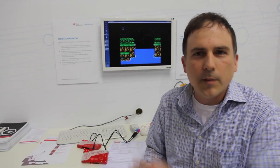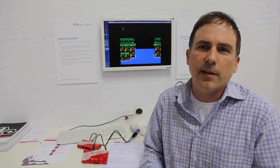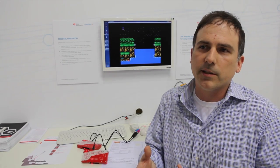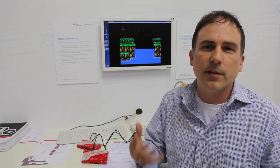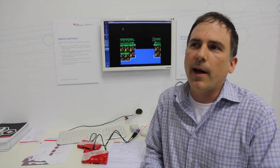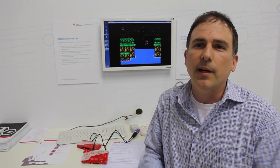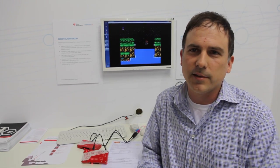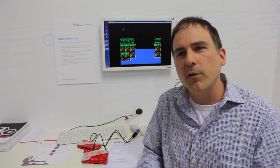We have the booster pack hardware, and we also have a software developer's kit that goes with it. The SDK includes a fully functional turnkey library for haptics. It also includes our capacitive touch library, combining the functionality of capacitive touch and haptics into one, with the application on top of that. We also have tools to help in your development: the Haptouch GUI, which lets you build your own haptics sequences like machine gun and rolling dice. It's a very creative process. And we have the Touch Pro GUI for capacitive touch.